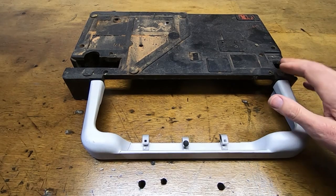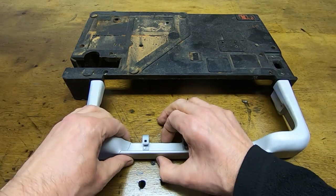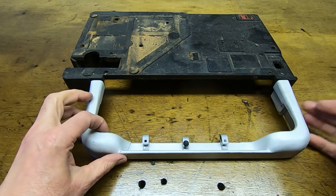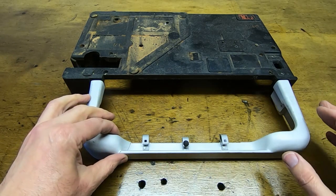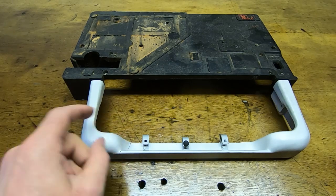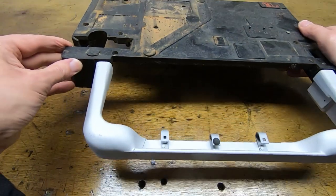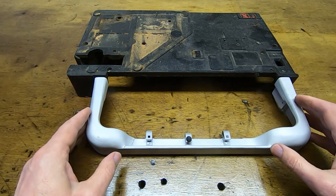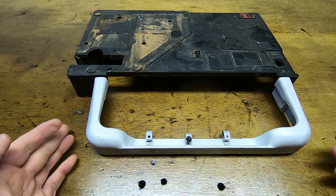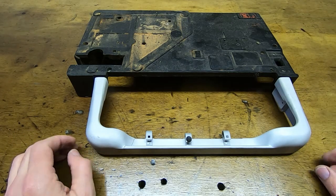The two parts are now bolted to the chassis. Luckily there are countersunk holes on the side of the chassis so it pulls everything into line. These bits are sprung slightly apart, but I think that's part of the distortion in the casting to start with. They're now perfectly aligned at the front, which is where I want them. The gap is only about half a millimetre, which will fill with weld. I've put a ruler on it and it's in a perfect straight line both on the front and on the underside.